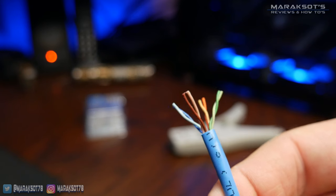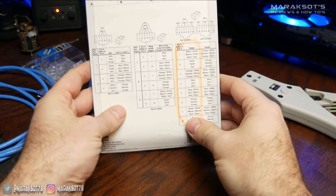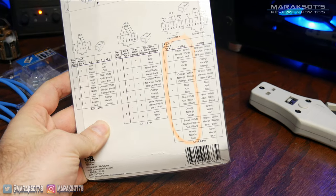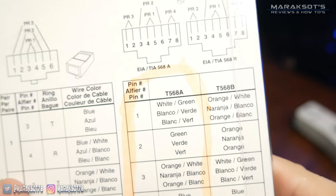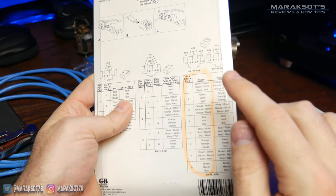We now have four different pairs of wires here. On the back of my crimp tool's box, there is a wiring diagram which shows us the order that we want the wires to go into the RJ45 connector. I circled T568A because that was the order on a cable I repaired a number of years ago, but I believe the standard nowadays is T568B. From what I understand, it doesn't make a huge difference which one you use — you just need to make sure the order is the same on both ends of the cable.